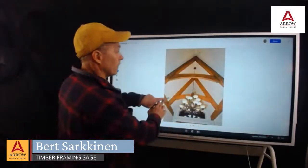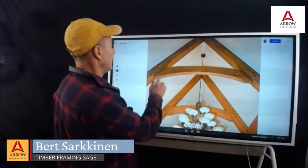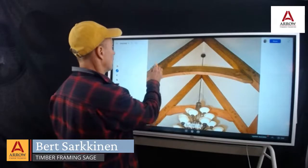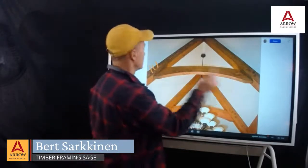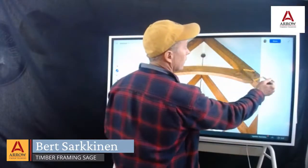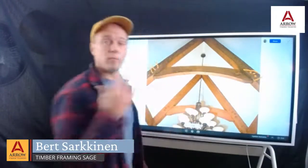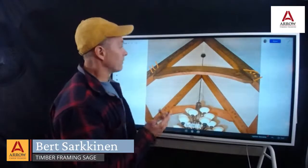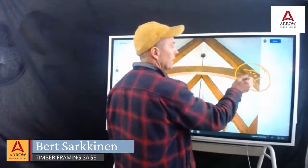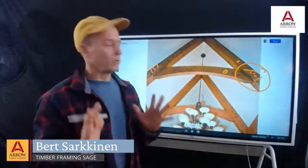Okay, so here's a real life example of that simple European style truss that we were just talking about. And you can see here the pegs. The pegs happen right here. You can see they're kind of in the center of the truss. So this tenon goes all the way through. And the pegs are in the center, which is going to be your strongest point in placing a peg. And that is, of course, this could be a cable, like you said. We're looking at how well can we connect this piece to that piece. And as long as they can't come apart, you know, we're golden for strength.